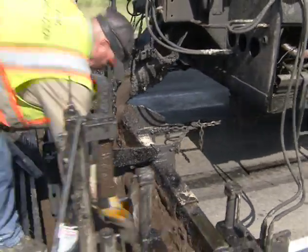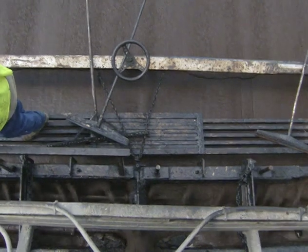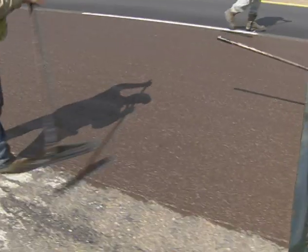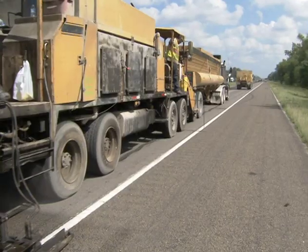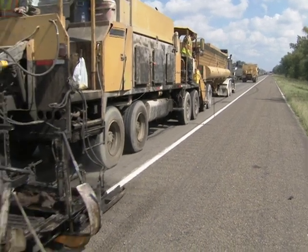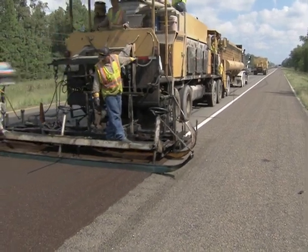If you're not going to stack a seal coat, you don't have many options. One option we've used very well on a high volume road is to put a layer of micro-surfacing on top of that seal coat and use it as a wearing course surface for five to seven years. We put a micro on top of the seal coat, get a good rut-free riding surface for five to seven years, then come back with another seal coat on top of the micro-surfacing — good for another five to seven years. About half of what we do micro-surfacing-wise is generally along the US-59 corridor.